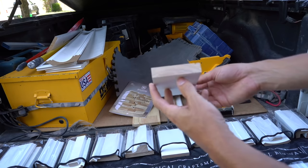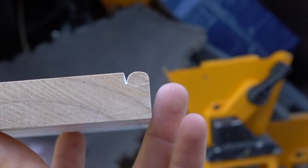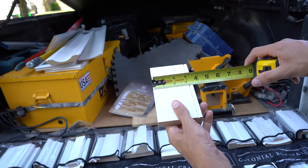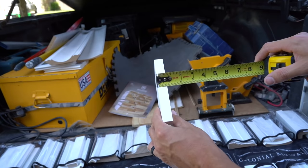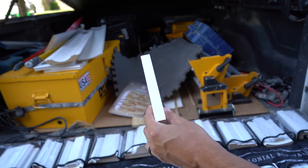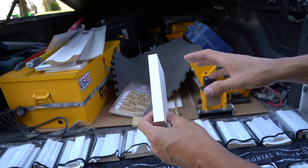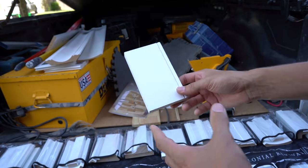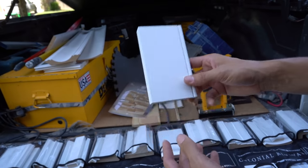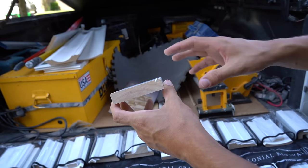This is another door or window casing with a nice beaded profile and a deep cut — again, not going to accomplish that with MDF. And this is a one by four, but what I love is it's a true one by four, meaning a true three-quarter inch board. Not five-eighths, not eleven sixteenths. You guys saw me struggle in the last video when my local stuff came in at five-eighths in some places and eleven sixteenths in others, varying even more than that in some cases. That's why I'm switching all of my one-by material to Windsor One.